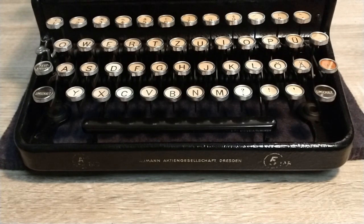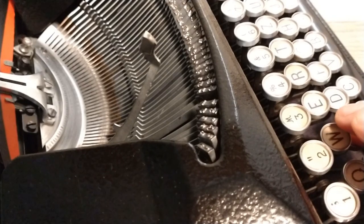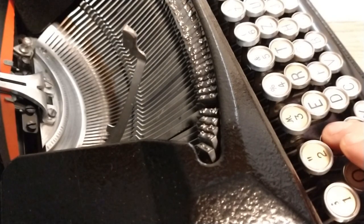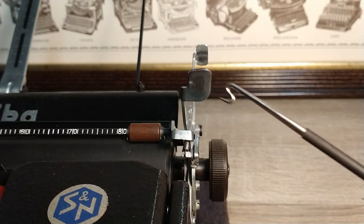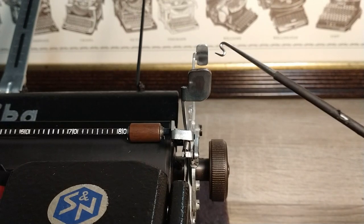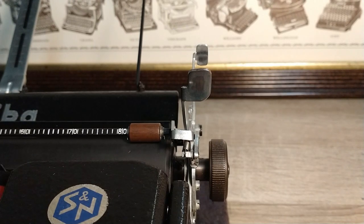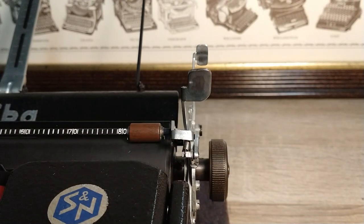This machine was a very well used machine, as the wear suggests. The front decals are almost entirely gone. The vertical alignment of the type bars has been adjusted many times, as these pinning marks suggest. The plating has a lot of wear and is even almost gone in different spots. You can't believe how bent and dirty these carriage release and paper release levers were. The legends of the paper bale were all gunky instead of white.